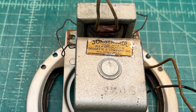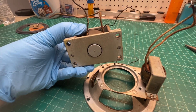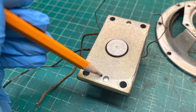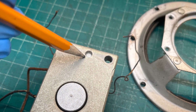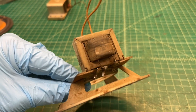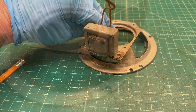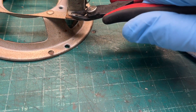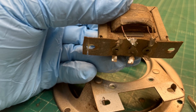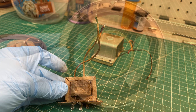You can see the wires are frayed as well, coming from the humbucking coil, and one of the four fasteners that hold the yoke back to the speaker basket itself. With the four fasteners loose you can see it simply lifts off, giving access to everything. The speaker builder keyed that bottom plate in two different locations for alignment purposes to keep the center pole piece in the middle. I've got those little ears holding the output transformer on, and I'll replace that broken terminal strip so we can tie down the leads to the output transformer, humbucking coil, and voice coil.